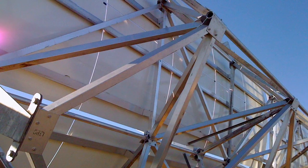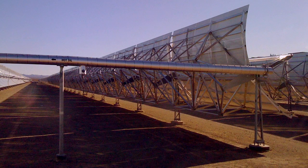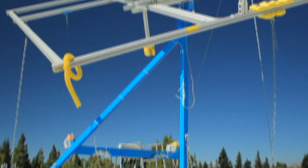Conventional means of solar thermal power generation are based around very ruggedly engineered heliostats laid out on carefully surveyed, graded, landscaped fields very precisely aligned so that they can be run under open-loop control. We're working with a closed-loop system. At every point in time, we know exactly where this heliostat mirror is positioned and we know where its reflection is pointing. And as a result, we can build structures that have much less material and much lower cost.